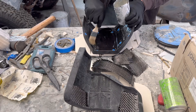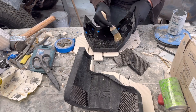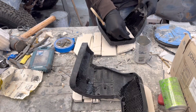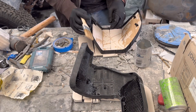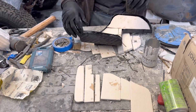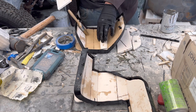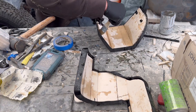Now all the ceramic pieces are cut, we'll layer some carbon fibre over the nut inserts and then get them all laid in. This first layer will be laid on top of the epoxy resin used with the carbon fibre, which I think will also be better for rigidity. Then when it comes to the second layer, we'll be layering that in with polyurethane resin — a medium soft variant — which we found better to use in previous ballistic testing. You are able to push these pieces together pretty well; the gaps in between are very small. It just helps to get all of the plates in and then push them all together once all the resin is in there, rather than trying to do it as you're laying the plates in.